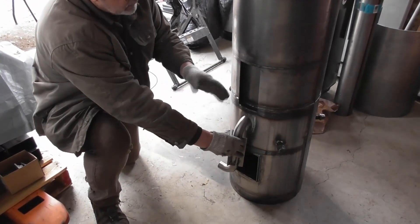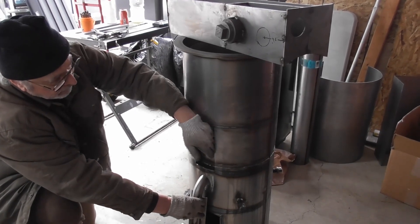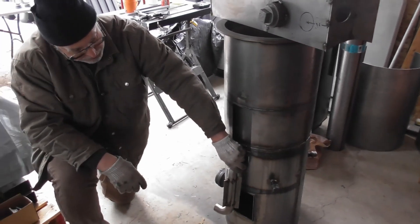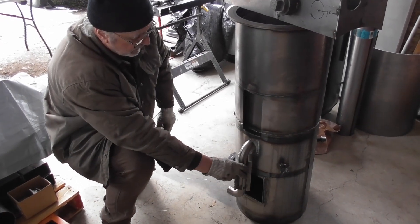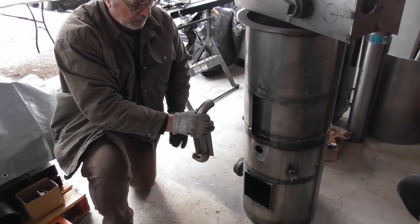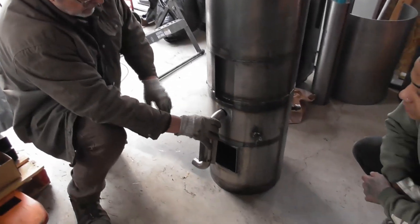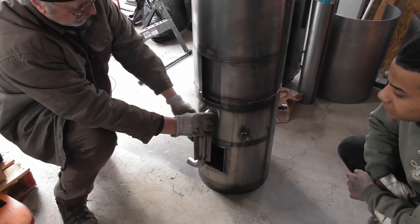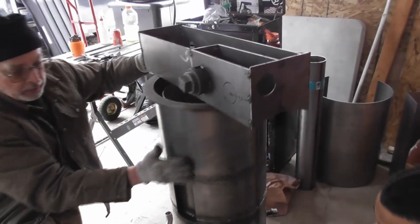The gas is going to rise, and with a divider plate, we're going to go in this hole, circulate around the pyrolysis liner, then come out and exit the heat exchange. We have to dry fit everything and get it in place before we weld this piece on, and it has to be leak tested as well. The last thing we want is a leak where we'd mix air and gas. So we'll leak test this, then dry fit it on the reactor, and weld it on with a good solid weld.